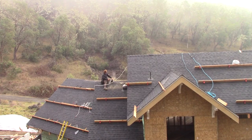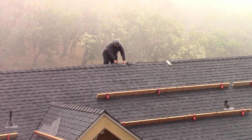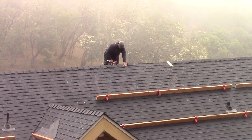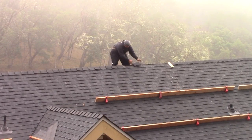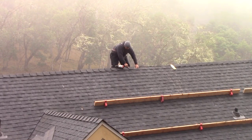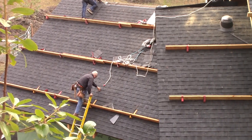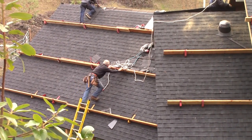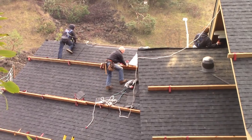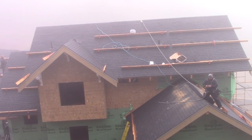Do you remember how much effort we put into the big vents in the bird blocks under our eaves when we were framing? We made those custom blocks on site so that plenty of fresh air could vent through, up, under the roof, and into the attic. Well, now it's time to finish that task by putting vents near the top of the roof. It's not enough to create a place where air can come in. It will do you no good at all unless you've got plenty of room for the air to go out.